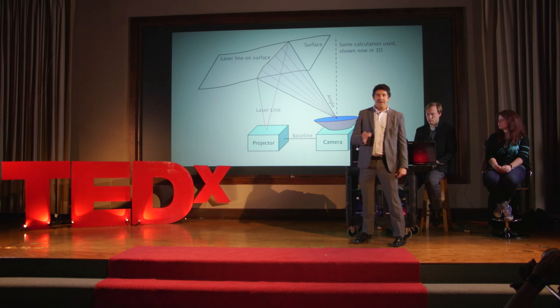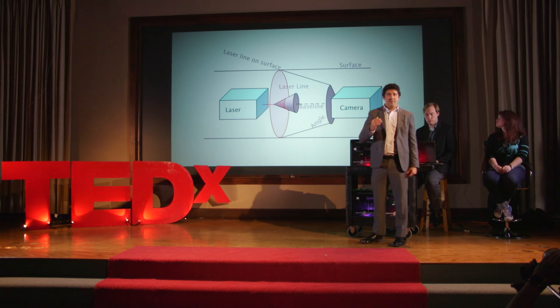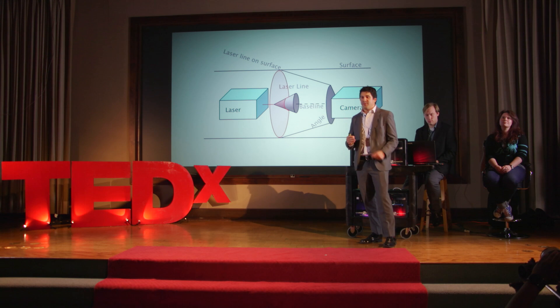You can expand that into 3D: instead of a laser spot, we project a laser line onto the surface. We take a picture of the laser line and, for every pixel along that line, calculate the distance from the projector and camera to the surface. Taking that further, we create a little ring of light, which is really well suited for scanning tubes or ear canals. You take a picture of the laser hitting the surface, figure out the angle along each pixel, and determine the distance.